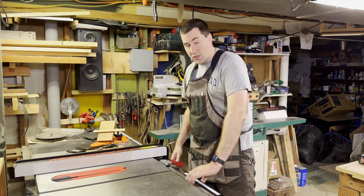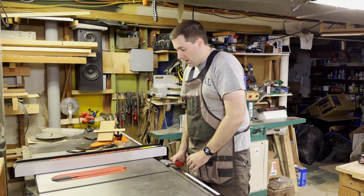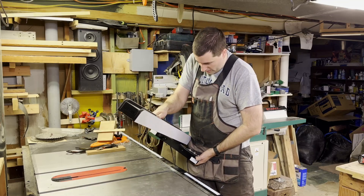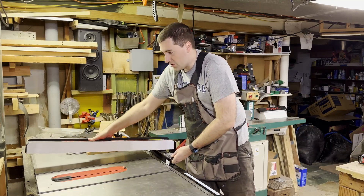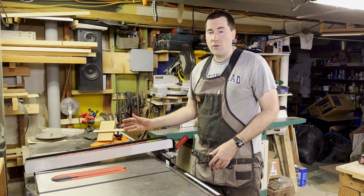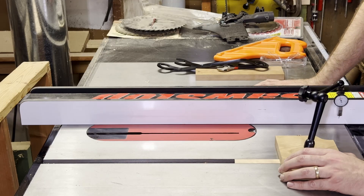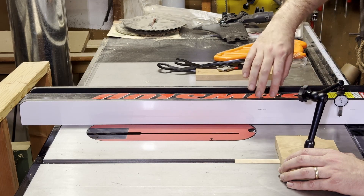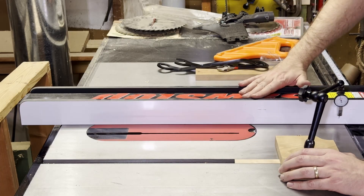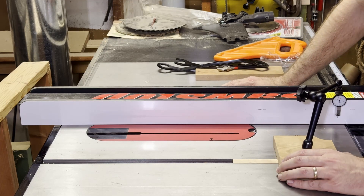This fence rides along on the square tube in the front and just clamps down on the front tube — there's nothing in the back that it clamps to. To adjust it, there are two screws right here, one on each side, and you can just tighten and loosen those until it's adjusted properly. We'll use the same tool as before. It's going to be a little hard to see since the dial is pretty small, but right now it's set at zero. This won't be quite as precise as the blade measurement since we're running along a plastic face on top of MDF, and this is a very sensitive indicator, so it'll jump around a little.